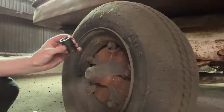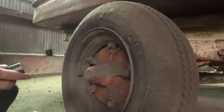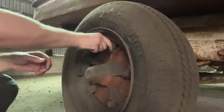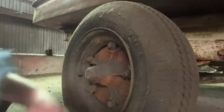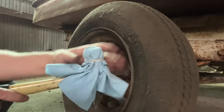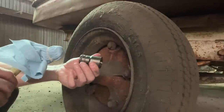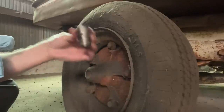You really don't want to use a power tool to loosen nuts and bolts like this — you can't control the torque as well. I'm going to use a breaker bar, which is a simple leverage tool, and a bolt extractor of the right size, which you can find by test-mounting. I'm going to install the bit onto the bolt with a 16-ounce hammer that I've turned into a dead blow mallet by rubber-banding on a couple of shop towels to soften the blow.